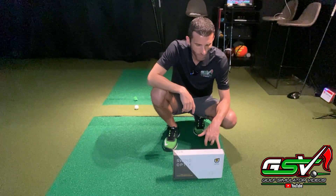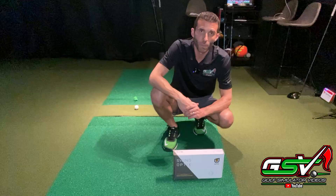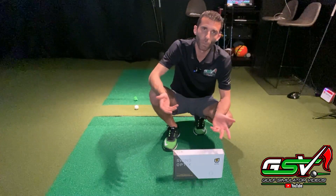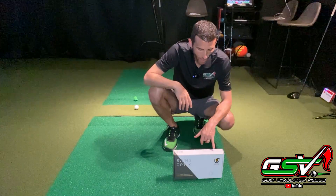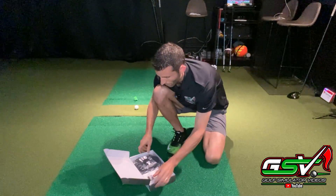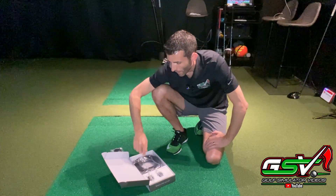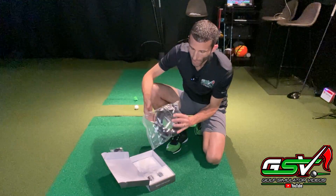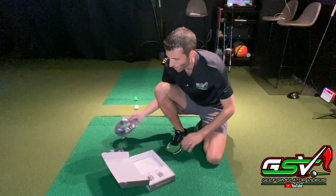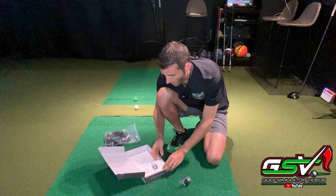The last spec here is it's tripod compatible for a quarter inch, which is really nice — you can get standard tripods like the mini tripod. That quarter-inch screw is the standard you see on the bottom of DSLRs and video cameras. So it's going to be really easy to grab a couple little tripods. Let's go ahead and unbox the system. It comes with velcro to secure the tripod, cables in one package — a standard USB 3 on one end, the USB 3 camera plug on the other — and then the two cameras, which have a very small form factor.